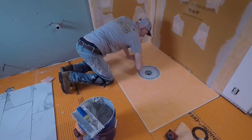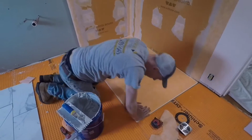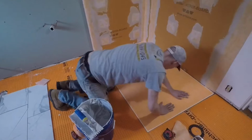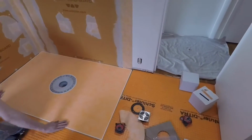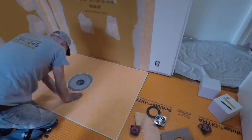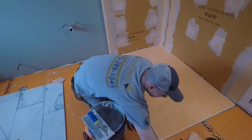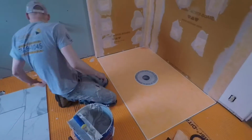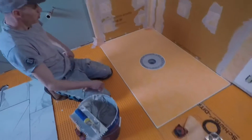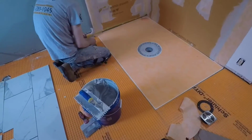All we have to do from here to get this to be waterproofed is just to band the pan to Ditra connection on those two outside corners. We're gonna bring the banding all the way to the door on the outside wall there, so it'll go under the outlet. And we're gonna use an outside corner boot on that little jut out of the wall right there. So we've got one inside corner, one outside corner that he's gonna just kind of put in place. And then a couple strips of band, and then our donut over the flange, and we're done.